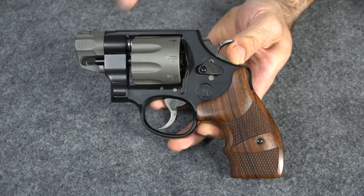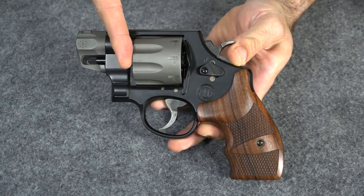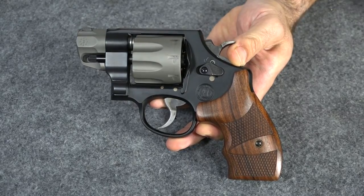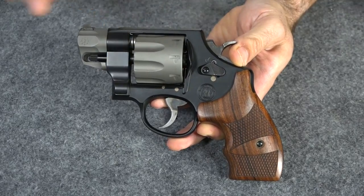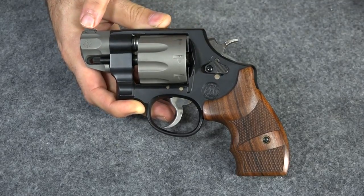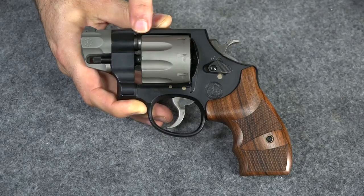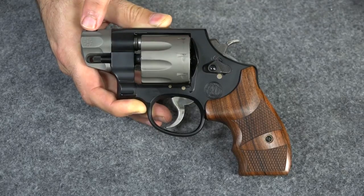357 magnum, 45 ACP — everything is shorter. Since they can't make a new frame for these guns — well, they could, but they're not going to, because that would be very cost prohibitive — they just put a shorter cylinder in here. A lot of people say, well why not just make the cylinder longer? There are two reasons: one is weight. In the day and age where carry is king, they save weight by making the cylinder shorter. Also, they make the gun shorter by not lengthening the cylinder, because this two-inch barrel can have a much shorter shroud on it if it goes farther into the gun. The barrel actually uses up that space.